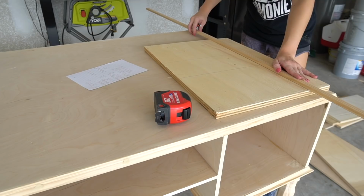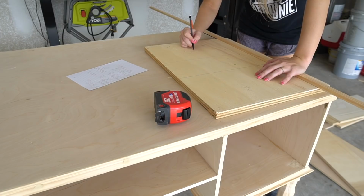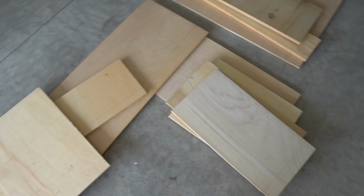You can also make the drawer height whatever you want. I recommend giving at least a 1/2 inch of space between the top and the bottom of your drawer frame opening. For my drawers on the sides, the opening height was 10.5 inches, but I only wanted my drawers to be 8.5 inches high. The middle drawer opening was 5 inches, but I made my drawers 3.5 inches to allow some good wiggle room.